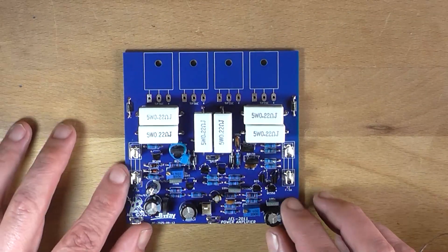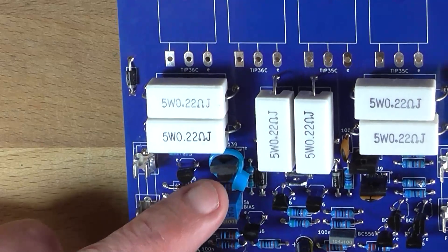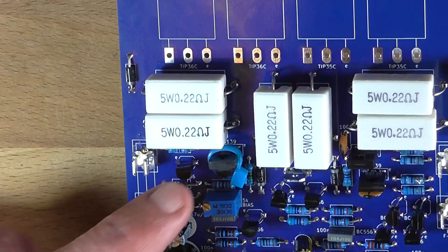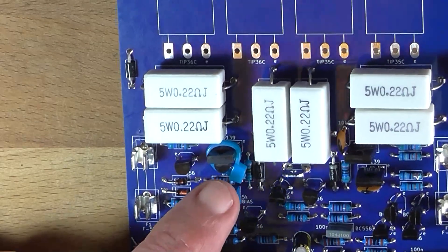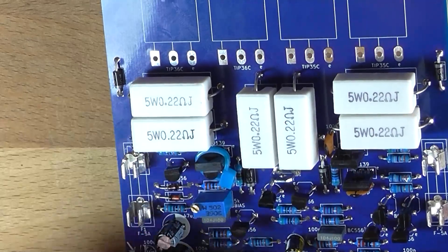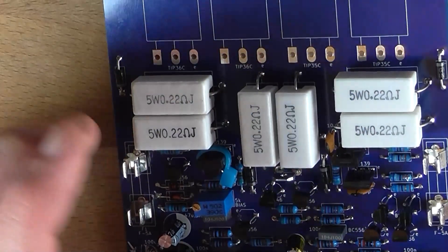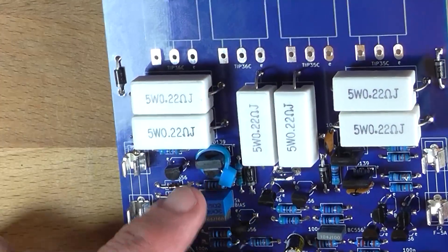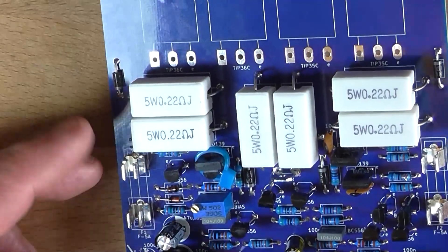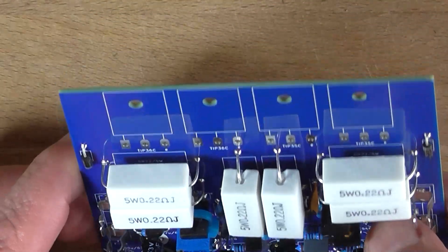This is what I meant about these two transistors — I've got a cable tie around the TO92 and the TO126. I clamped it before soldering so it wouldn't stress the solder joints and pulled the components into position, then soldered it. Then I had trouble with the zip strap falling below the transistor and had to cut it off and put a new one on, but I've got solder on a resistor — not anymore.